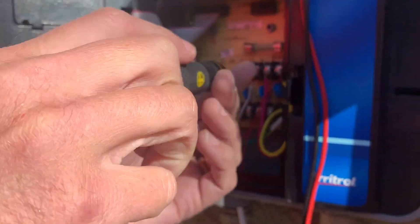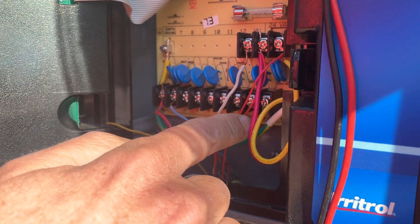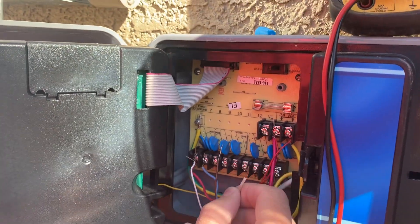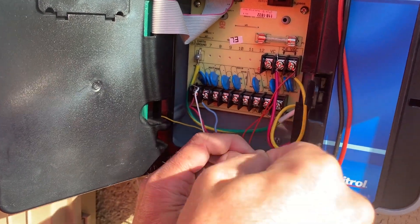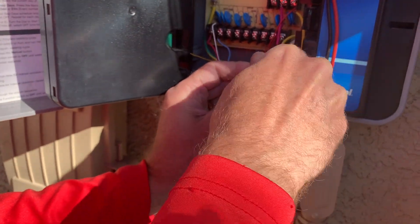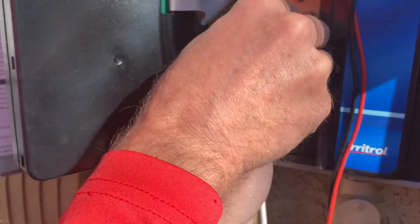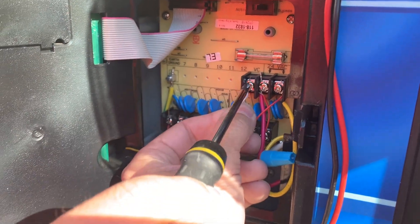So we just disconnect the common wire — it'll be up here, or on some other models it might be over here or over there. Just look for VC, VC common. I'm going to wire up the brown wire and the common here — the brown coming off the receiver. All I've got is a grease cap so we'll use that instead of a regular wire nut. Twist it on there, pull it to make sure it's good. Take this other common from the receiver and wire it in there, screw it on, and then we're going to go test it.